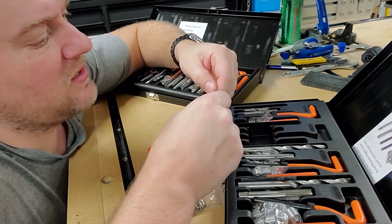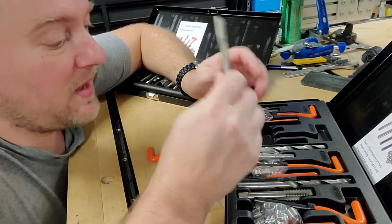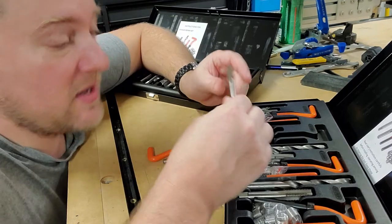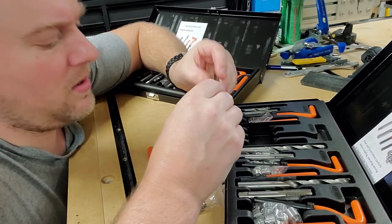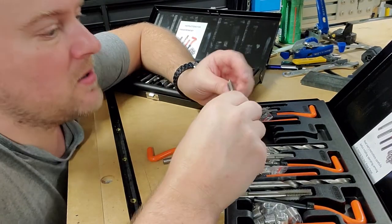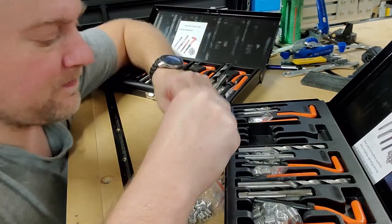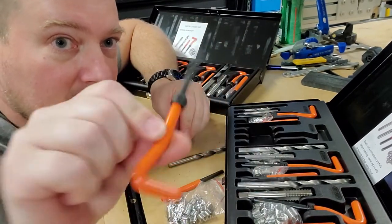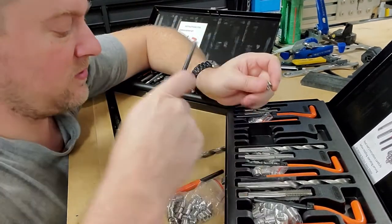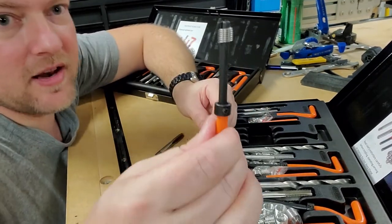The tap edges are chowdered too. I love twist taps and I'll probably rebuild these kits with twist taps because I trust them a lot more. That said, this metal looks pretty hard — it doesn't even scratch — so we just have to worry about brittleness. Each size has its own tap. You also have the helicoil applicator, which is a little hook with a slit in the end.